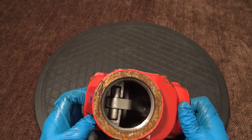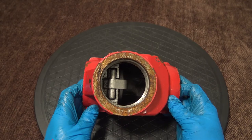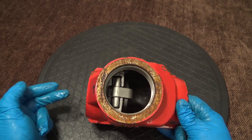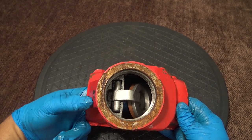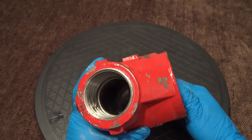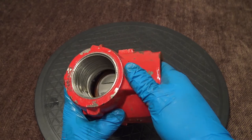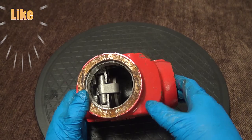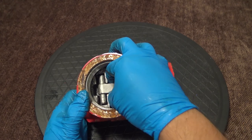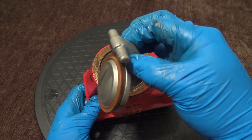Here's a look inside of the valve body without the bonnet. You can see the clapper there inside of the body slot. The flow will come in this direction and push the clapper up. You can see the clapper freely hanging and swinging inside there. To remove the clapper, grab it, push it away from the body seat, and pull it up out from the body slot.